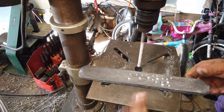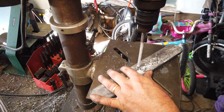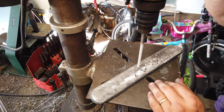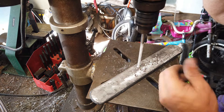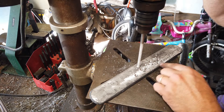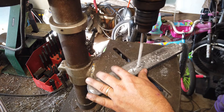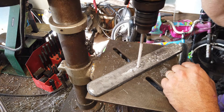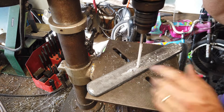It's a pattern that shows up, so it's kind of time-consuming — you've got to sit here and hammer away on the drill press to make as many as you can. For the random raindrop pattern, they fall randomly. You can have them kind of overlap, right next to each other, kind of like an elongated drop. I'll do one right there and it'll cut into the next one a little bit — so you kind of have two drops that fell next to each other and coalesced.